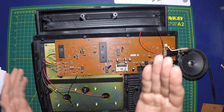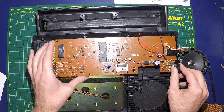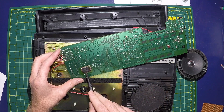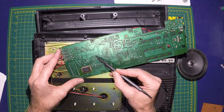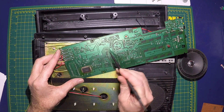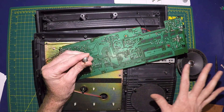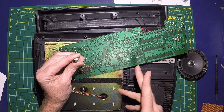So that will flip the signal — instead of triggering when the gate is triggered, it's actually when the gate is released. And then finally I will be doing a kind of data line mod, like with an FM keyboard. There's a CPU chip and a sound chip and there are eight lines connecting the two. I'm going to come in here and cut these eight traces, then wire eight of the traces here and eight over here, and wire those wires to eight toggle switches. That will give me the ability to have them all closed in the normal position, select a sound, and then break some connections and distort the sound and morph.